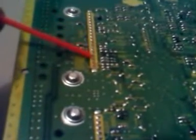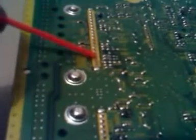One thing I want to mention: on the back of the board, use a magnifying glass to check your solder work afterwards. Right here is the backside of one of the convergence ICs, and here's the other one. Use a magnifying glass and make sure you don't get any solder splash or solder bridges, as that can cause a whole world of other problems. Clean the board and your solder work afterwards — I like to use 100% alcohol, which leaves no residue and makes for very good cleanup.